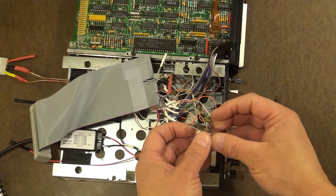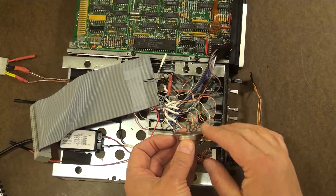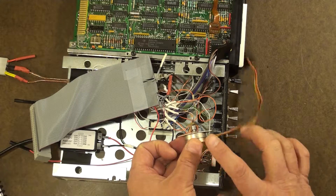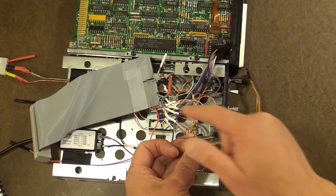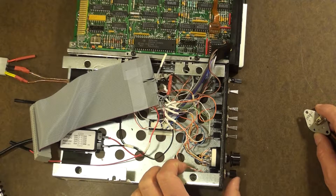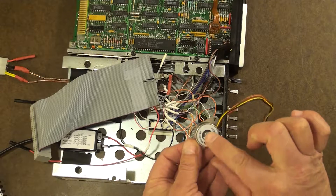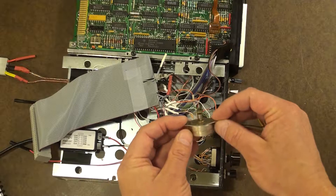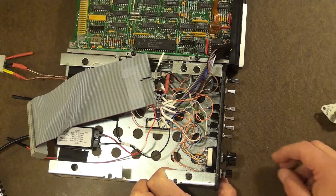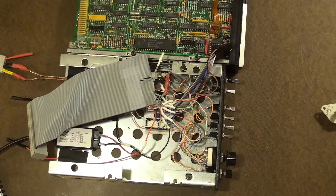The reason for the momentary switch is that to get this motor to move decisively, I'm putting more voltage into each coil than the circuit normally puts — I'm putting 12 volts into every single coil. That's a little bit overkill, but it really gets that thing to move and it doesn't miss a step at all. The problem is, if you accidentally left 12 volts on one of the tiny coils, after a minute it would overheat, start to smoke, and you'd burn out the motor. So don't hold this in for a long period of time — it's designed so you only hold it in while actively turning the dial. So far that's been extremely successful.